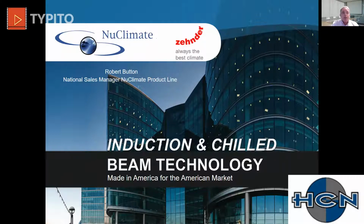New Climate was the only US-based company producing induction units and chilled beams back in the early 2000s. And so made in America for the American market really meant something, because these guys were engineers and executives from Carrier who formed this company, and they really felt it was important to adhere to the International Mechanical Building Code that said you had to have a drain pan under a cooling coil or an evaporative coil. So from the very beginning, that is the stance New Climate took. We're going to not only provide liability protection, but what that drain pan is going to do is open the door for a multitude of designs that you're not afforded with a sensible only chilled beam.